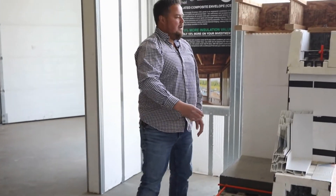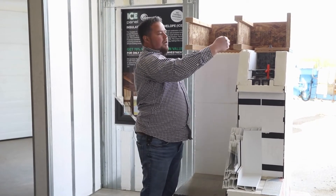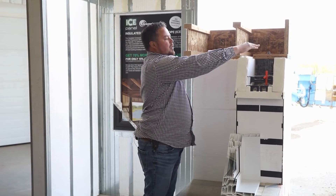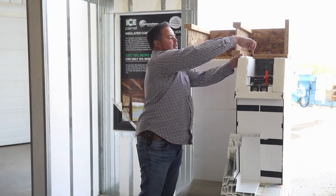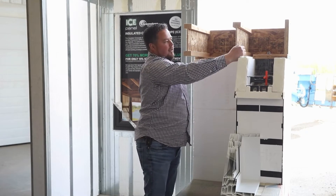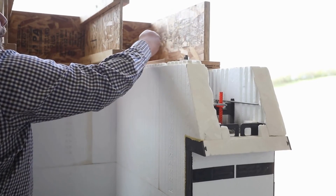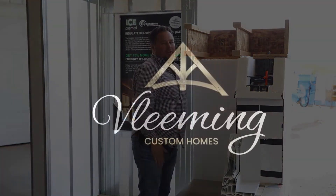As we move up the wall here, this is the top of the foundation wall. If we are transitioning to wood frame construction at that point, we start with a mud sill plate put on top. We intentionally leave this plate narrower than what the actual wall is, because later we're going to add spray foam insulation that comes down here and connects to this ICF to get that continuous insulation again.